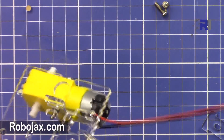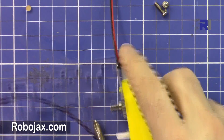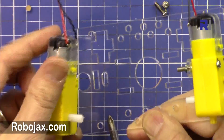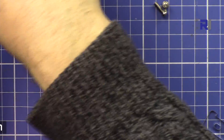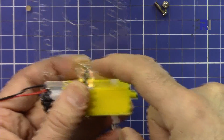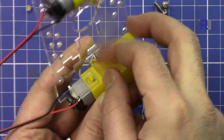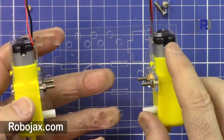This is the top, so you insert it and put the motor. I'll do the same for the other motor - again making sure the wires are on the inner side. Get this piece, insert from the bottom, then pass the screw through from the lower one first, then the top one, and tighten the nuts. This looks loose but don't worry - when the other part comes on top of it, it will be held tight.